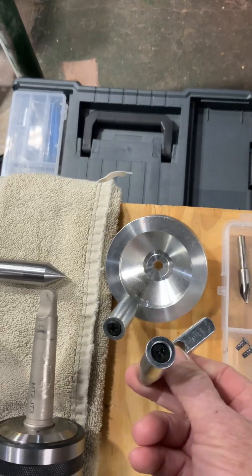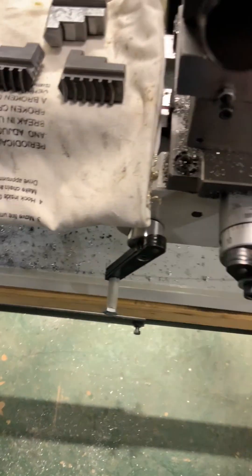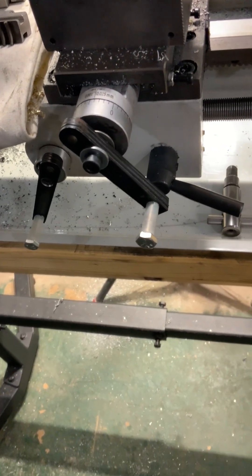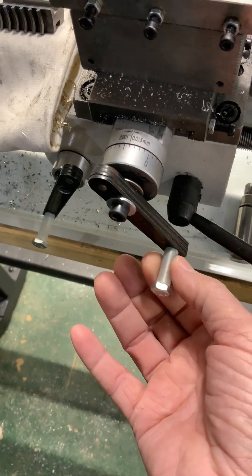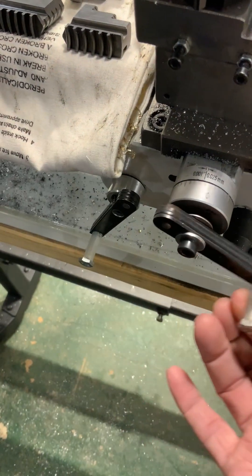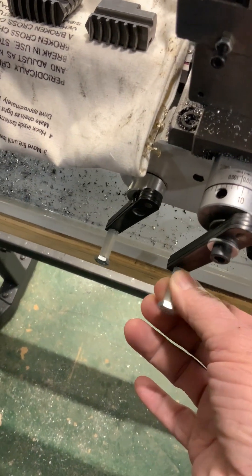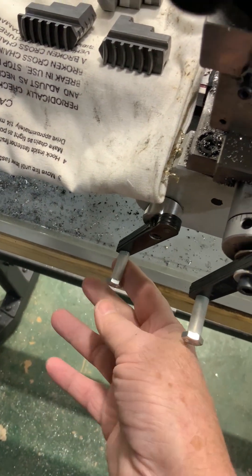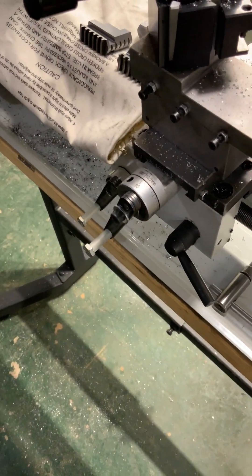All the handles were made out of aluminum — quite loose and crappy. They just have a screw in there and they don't fit very well. So I made all new ones. Mine are longer, fit quite tightly and nicely — just a basic bolt with a piece of plastic over it, but it turns very smoothly. I can turn smaller increments than before. I had to make a bushing for one that was bushed out, and I replaced all three.